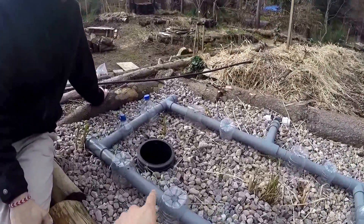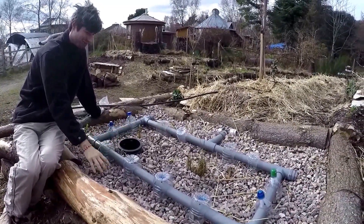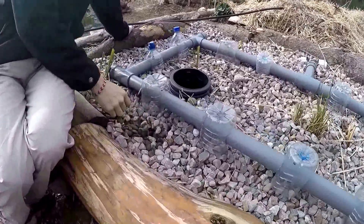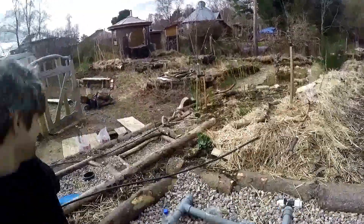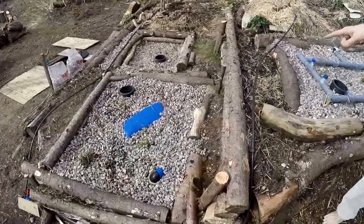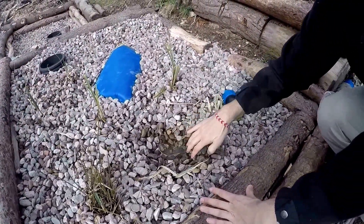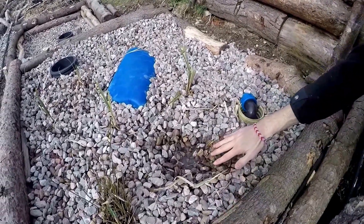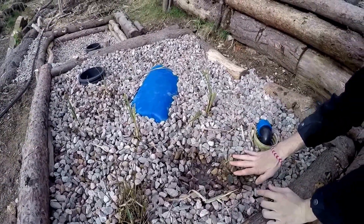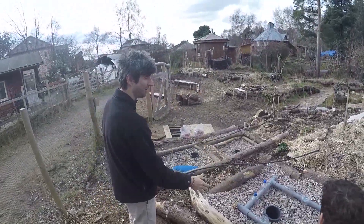This reed bed has all the stones in it and eventually reaches the point where it gets too full of water. This is designed to happen — this is its overflow, which pushes it into the next system: the second reed bed and the third reed bed. If you look closely, you'll see there is some water in here. It stinks, but it doesn't stink as badly as the first one, and the third one doesn't stink much at all. It's an overflow system — pumped from the lower barrels to this high point, and from here it can go back down again through the garden.